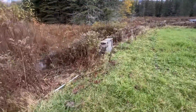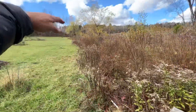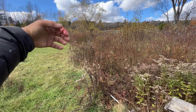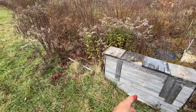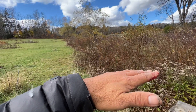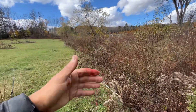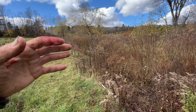How a ram pump works is really phenomenal. I'd recommend looking up animations of them online. It's also called a water hammer, which makes sense if you think about how it functions. Water coming down a hill has energy, and if it's in a pipe, that energy can be contained laterally when you stop it. The check valve drops, and instantly the momentum of that entire water column — which is heavy — stops.